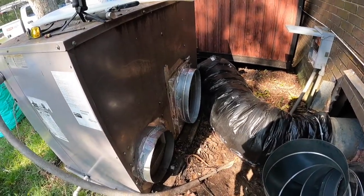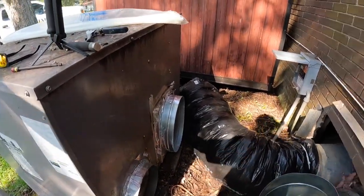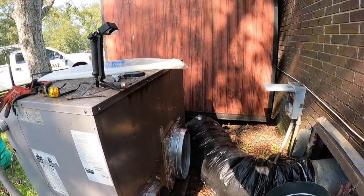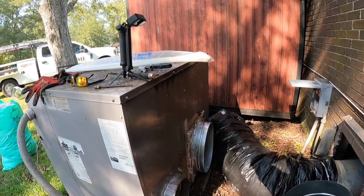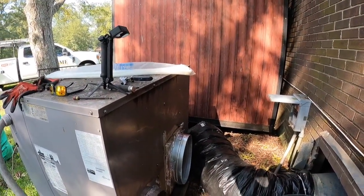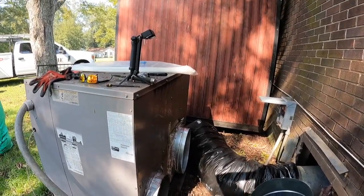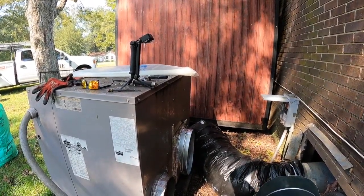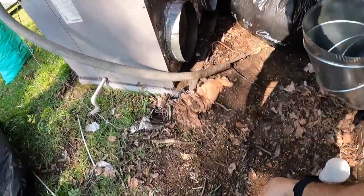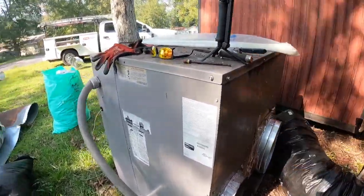You know, the whole idea here is to make this airtight. So what I'm going to do is put some mastic around this takeoff instead of trying to get all of that tape off. It'll look better with all the tape off, but it's also going to be under the cover here, and we're worried about performance and airflow. If it's exposed where people can see it, obviously you want to make it look as good as you can, but taking all that off is not worth the customer's money to pay someone to sit here and tear all that off.